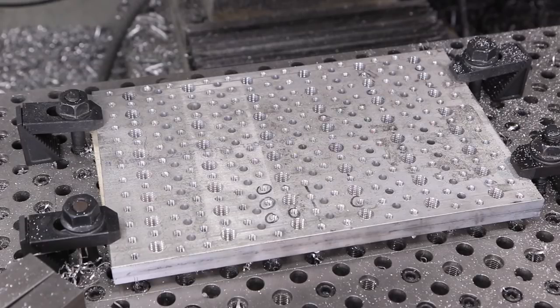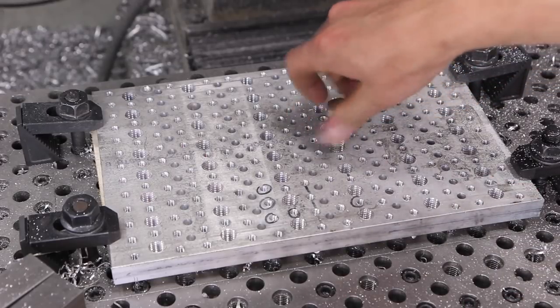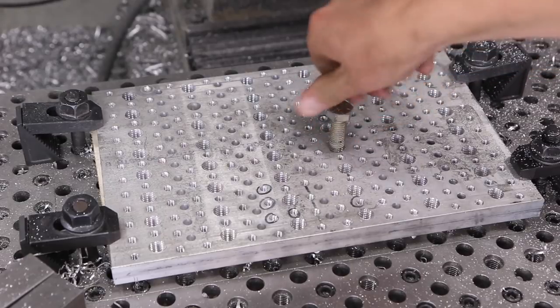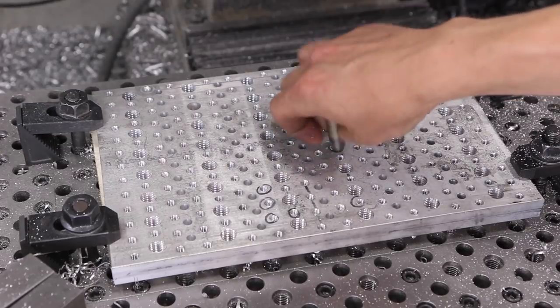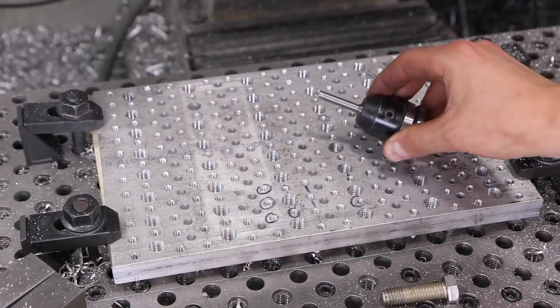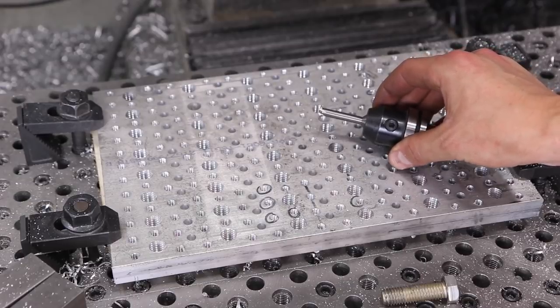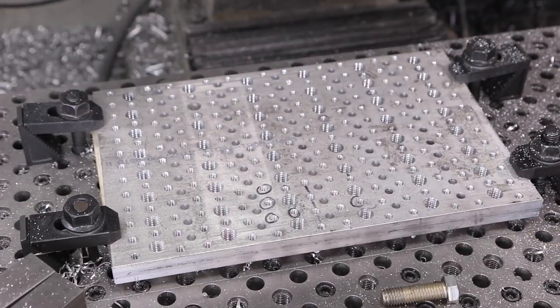All right, thread milling is done. I meant to videotape it, but I got a phone call and got distracted and it was done before I knew it. But looks great, and more importantly, we have a great thread fit. That's what I love about thread milling, folks. Just awesome. We are using this guy right here from Lakeshore Carbide, and I actually did take an additional 2/1000ths on the radius, so 4/1000ths overall, to get that fit that I wanted. That's what I like. We can adjust that fit though.